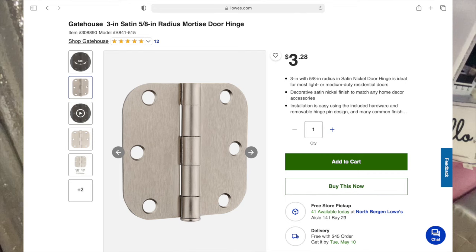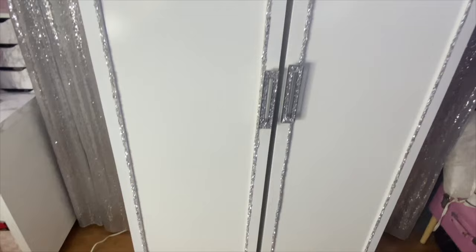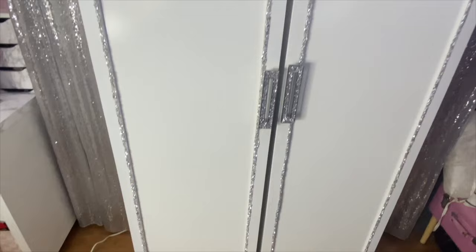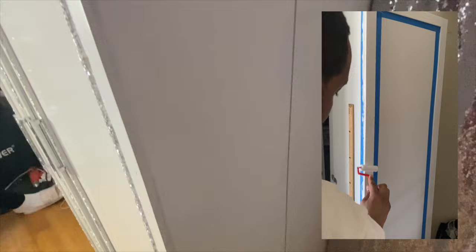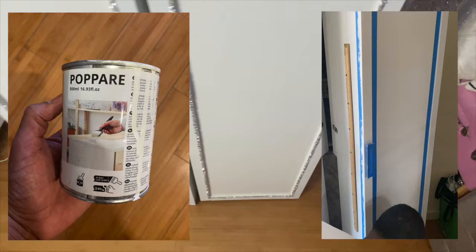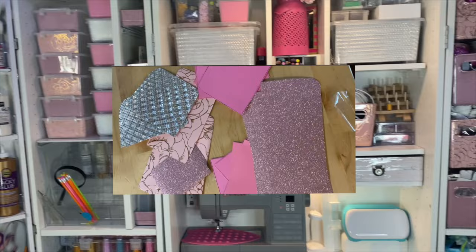We installed the three frames with the crown and the extended doors, and my wife is opening and closing them to see how they work. Here is the first completed version of the vision box. We made quite a few changes — the first being the hinges. We switched from 2.5-inch to 3-inch hinges so the frame can open and close a lot better. We purchased the door handles from Amazon. The next change was the door frame. Although the glitter ribbon made the vision box stand out, it would peel and leave a mess, and it would scratch our arms and legs. So my wife had me scrape it off, sand the door frame, and repaint it white using IKEA paint.